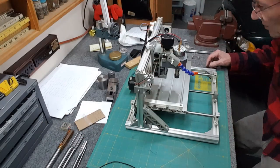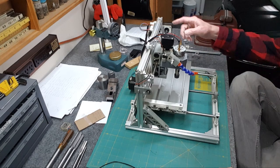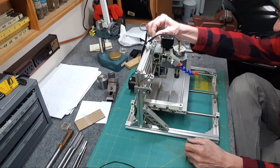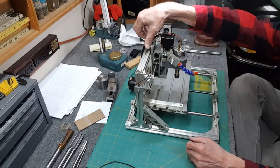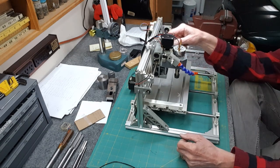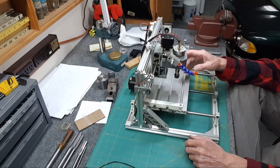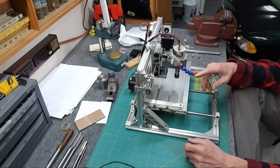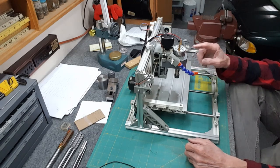I'm not going to show much more of where I'm going from here, but just to give you guys an update — a lot of spare parts came off. This piece has to stay because it's the limit switch, but this does not move. What I'm seeing is I cannot turn this wheel by hand, but I can turn this one. So I've got to take it all apart. There's play in the holes, so I've got to make sure all the screws are in the same position to get rid of that little play.